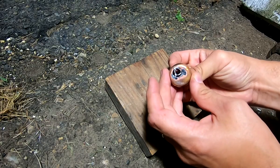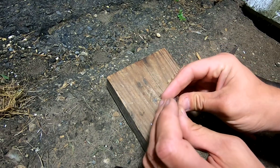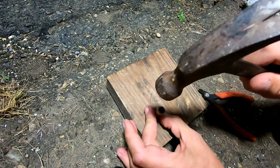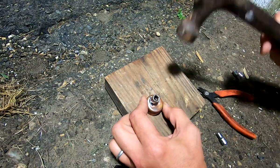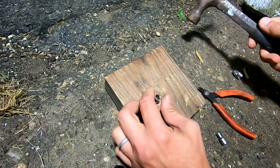It turns out that the cup the drill mangled had too much gap to solder. To tighten the joint, I took a small socket and pounded it into the end of the pipe to flare it out a bit. I flared the tube a little at a time until it was big enough to fill most of the gap, and the solder filled the rest.